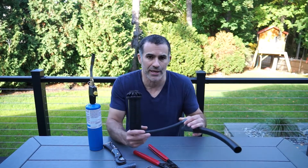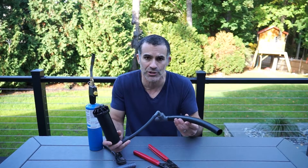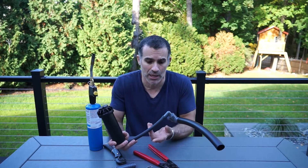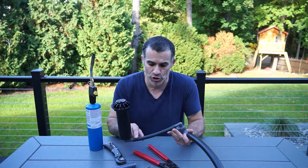The next thing I'm going to talk about is the anatomy of the sprinkler system below ground. The sprinkler system is comprised of your main line, which is generally an inch in diameter. This main pipe will branch off and feed your heads by way of these funny pipes. When you're looking to tap your main line to add more heads, you want to find the head that's closest to the area where you want to add your incremental heads and trace the line back to the main line. This is the line you'll tap for more heads.